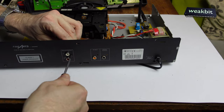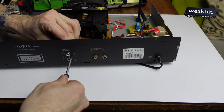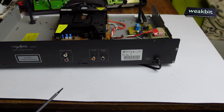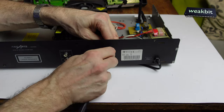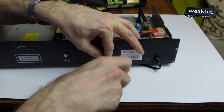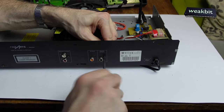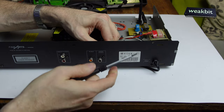So you can see this. Install that step by step and count the screws. All screws must be back in the same position as where you get them from, or where you build or disassemble it. This is important because some of these screws maybe have a grounding function for these connectors also to the body.